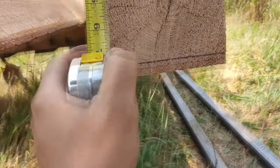All right, guys, we got it all milled up here. So what we got is our 6x8 true dimension beam there. We've got several different live edge slabs here that, if you made them into straight boards, you'd get a 1x6 to 1x8 out of them. A couple more over here. And then we've got a couple 1x6s here, and some of them right at the end have a little bit of the round of the tree on them still. That one underneath is pretty good still. But yeah, we made lots of good wood out of that one log.